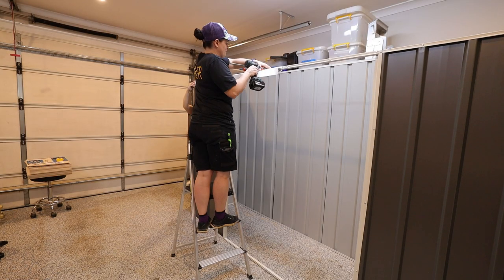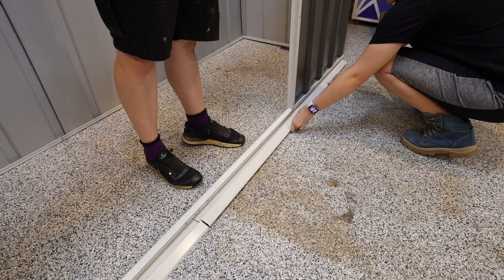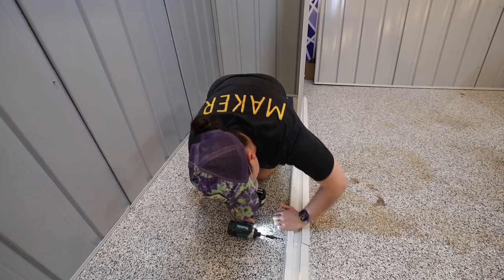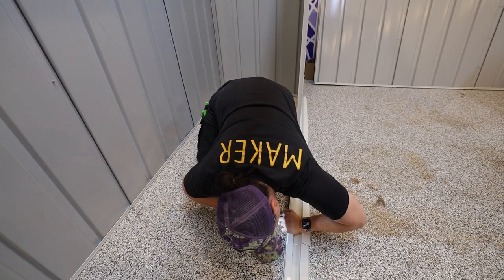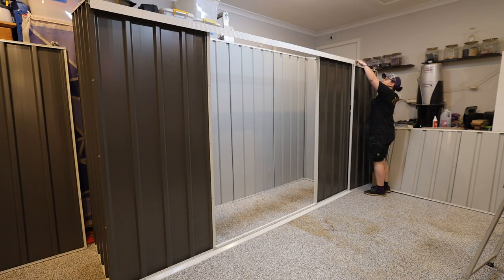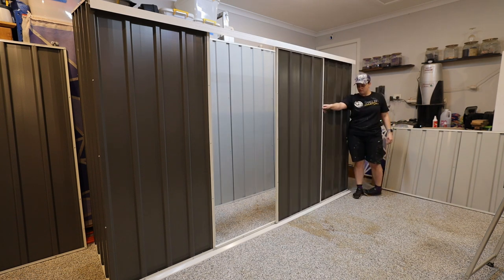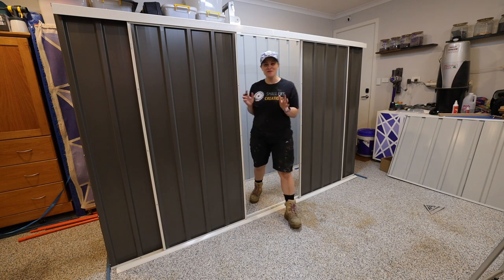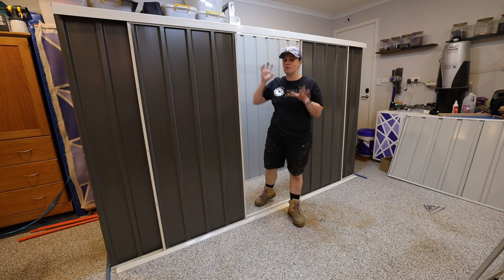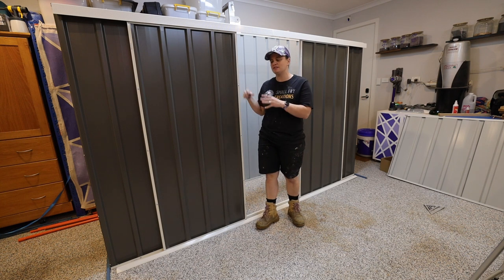We were making good progress. We attached the door track to the top and bottom of the front panel. It was helpful to have the engineer hold the timber pieces either side of where I was drilling to create pressure, as the metal flexes very easily. Then it was time to put the doors on and test if this thing worked. We have doors and almost a shed — things are looking up. The next step in the instructions is to attach the roof, but we're going to hold off until we have built the deck the shed will sit on so we can attach it squarely.